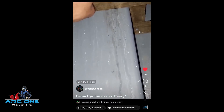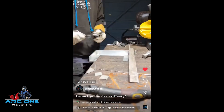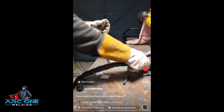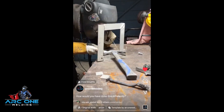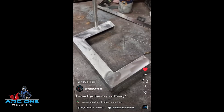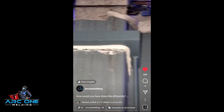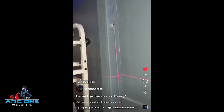I'm actually proud of myself for this one. A customer had a weeping leak on their roof running down a column — they couldn't fix it. So I turned up, made a wooden template of their wall because it wasn't square, took it home, traced it onto my table, and fabricated a gutter for the leaking column. It was a fun little project — I'm more into pipe welding, but needs must. I went back to the customer to find out where the drain hole should be, marked it up, took it home, drilled the hole, sprayed it, and installed it. All the angles slope back to the drain hole and also slope to the right, so all the water runs down to one point. They can use a bucket and there's a bung at the bottom to empty collected water.